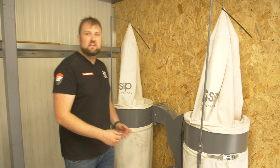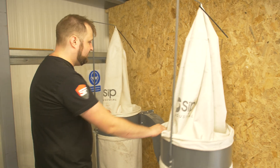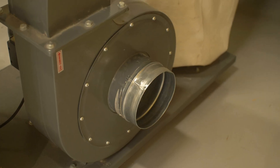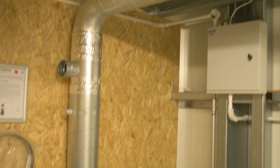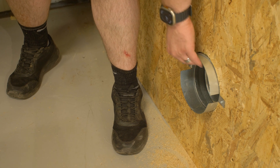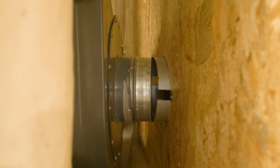Also when it comes to emptying it, it's going to be easier doing it here. So I'm much happier with it outside the shop and obviously it's on wheels so we can wheel it away from the wall — we've got this plug and socket arrangement. So essentially on the back we fitted a 150mm coupler and then on the wall we've got an elbow going through and then up. On that elbow we've put a little section of 150mm galv pipe and we've cut two wings just so we get a really solid fix, so this can plug and socket in there.